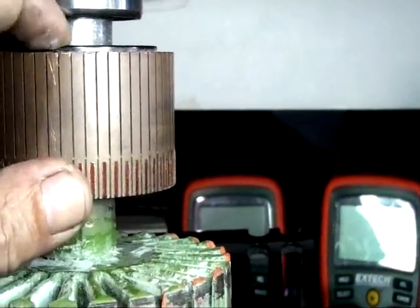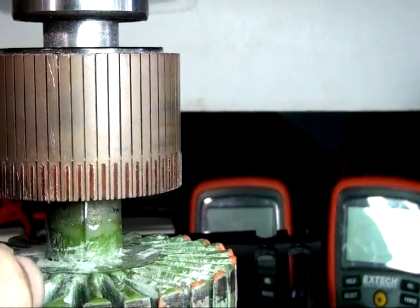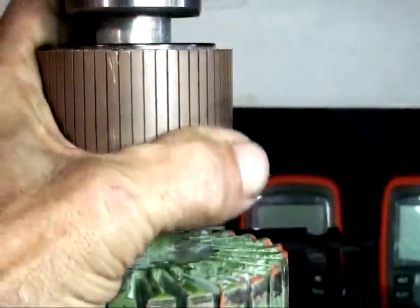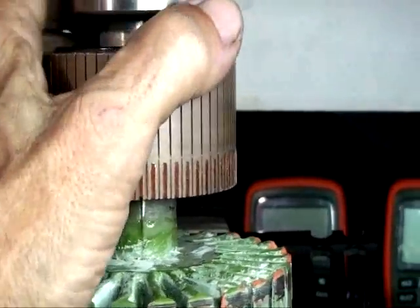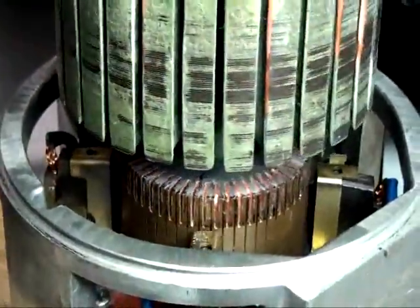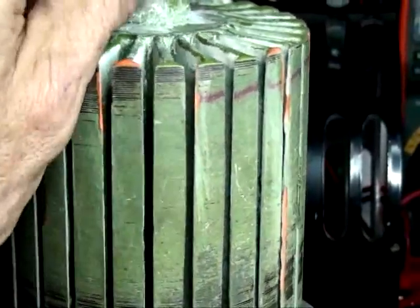This commutator has inside of the mica a metal steel ring, and that's actually what mounts on the shaft. These motors are very good — they are excellent. This is not just mica and steel; they've got a built-in steel ring in there. We got it going. I still got to smooth it down and then start winding it with the P28.